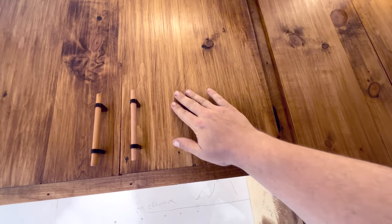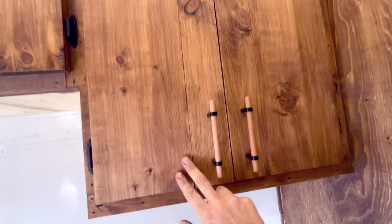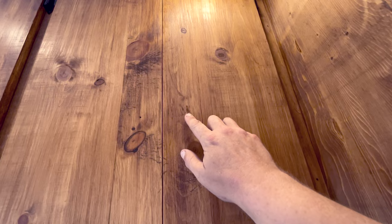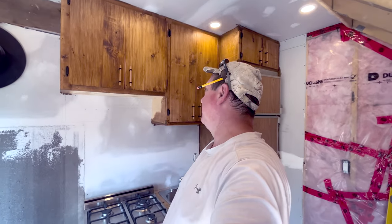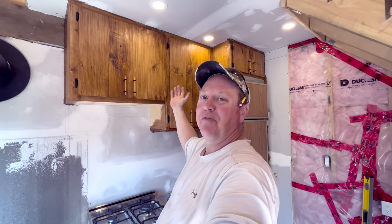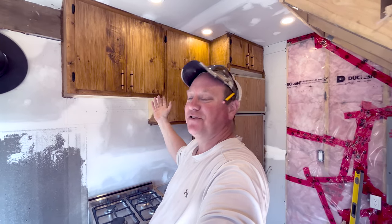And then when I sanded these, I must have gone against the grain in a couple spots, and so I've got these against-the-grain grooves, and that showed up when I put the stain on. It looks like I might have dripped some stain in a couple spots, and there's another one up there at the top, and let it sit there and soak into that one spot too much before I wiped it. So it's a couple imperfections, but just like me, I'm not a perfect person. It's in my image, I suppose.